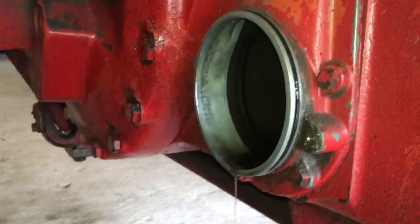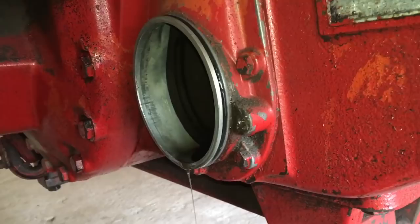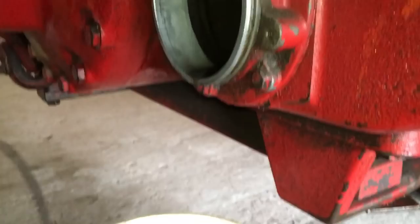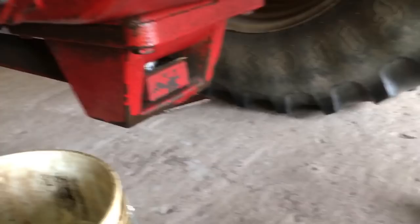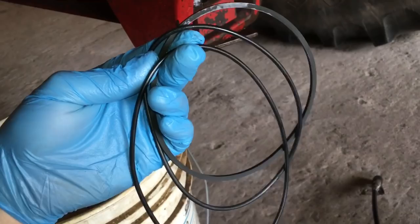There's an o-ring that goes around the outside — that's what seals this. Let me get my o-ring pick and the new filter. Take the old o-ring out of the housing — it's not very difficult. One thing you'll want to do is clean out that o-ring groove; if there's any dirt in there, get it nice and clean. They give you three different o-rings in this Baldwin kit — a square one you're not going to use, and two round ones where one is longer than the other, so you just have to find the right diameter.